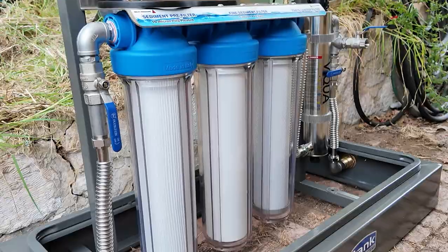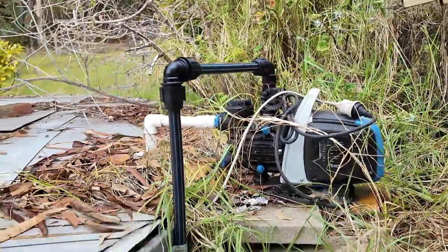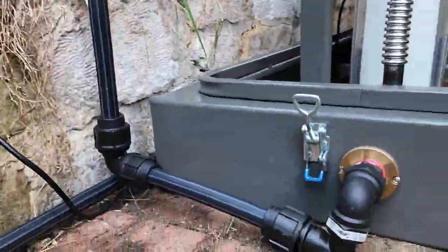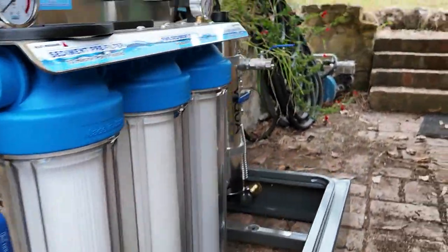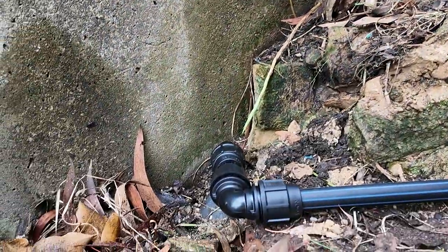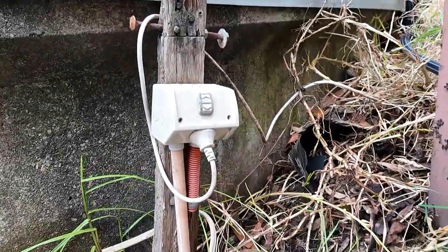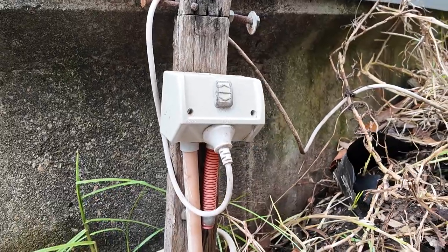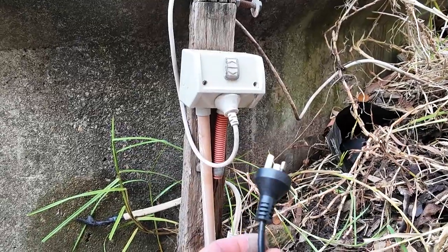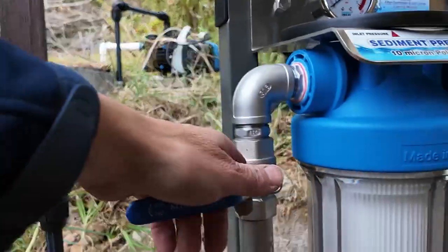There's your inlet pressure and there's your isolation tap. What I've done over here is come off the top of the pump with blue line, goes down here and across to the inlet. Water arrives inside the unit, runs through, and as we saw before goes round the back, comes back down into the return line, just down there, back into the house. Now the electrical over here is Dodgy Brothers Central, so the client is going to have that replaced. There's a UV cord here - I told her to get it fixed first, put a double external power point on, and then we'll plug the UV in. Don't want that going in there until that's done right - there's only damage to the unit.